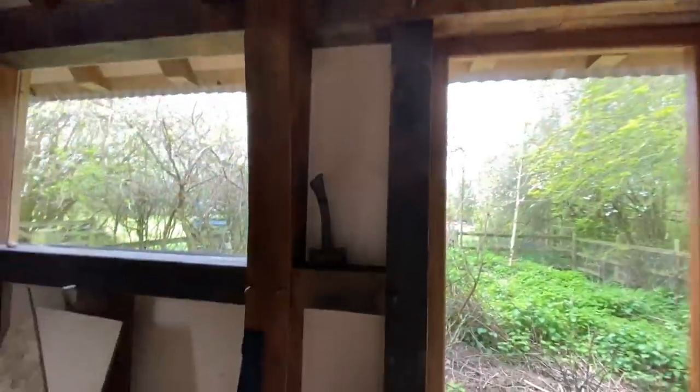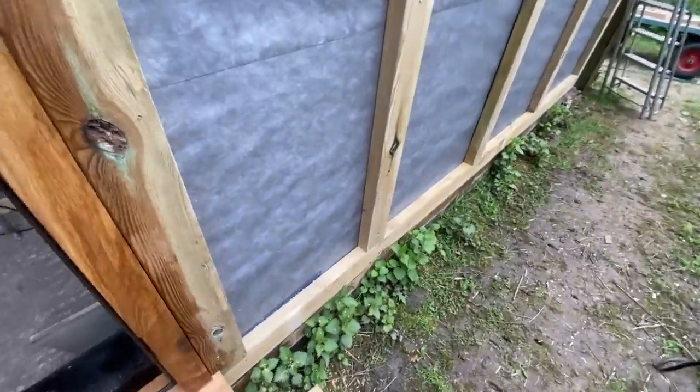They've got this wooden paneling here, like kind of ply boarding, basically. Instead of plastering it, they decided to just do this, and it's quite a nice finish. But what I'm going to be doing is putting in double sockets in places like this. So I'm going to have to multi-tool out the holes for the double sockets. And then on the other side, we're going to run all the cabling.